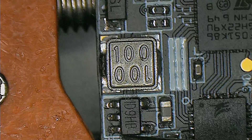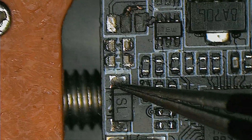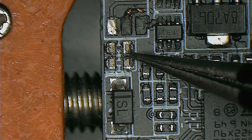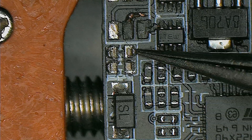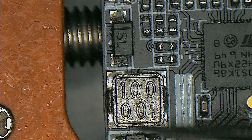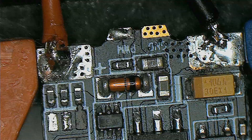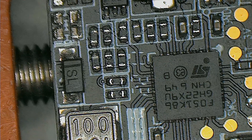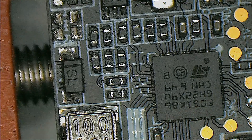The switching voltage regulator sits here, goes through this inductor, through this diode, and after that we have the caps to ground — which is this one. Without those caps the voltage regulator is in an unstable mode. Connecting it to my power supply I can see 80 milliamps, which is a bit excessive on an ESC that is sitting and not working.